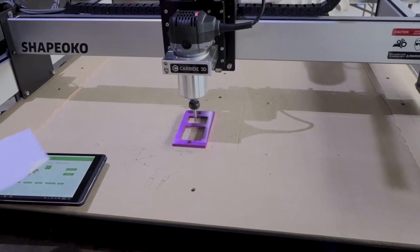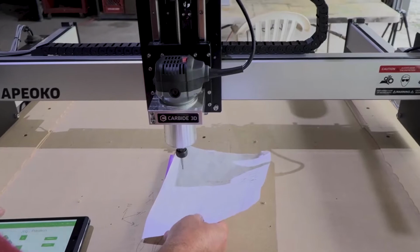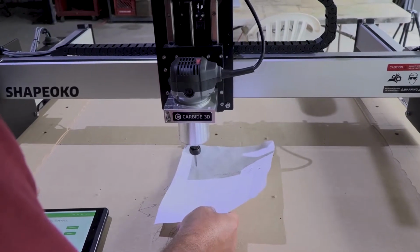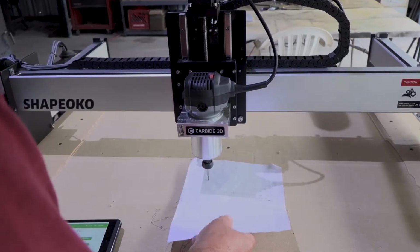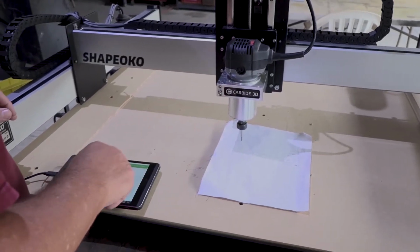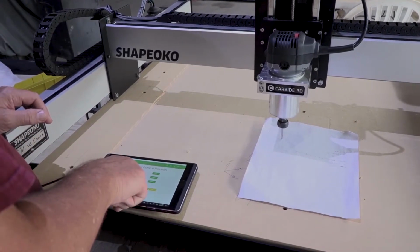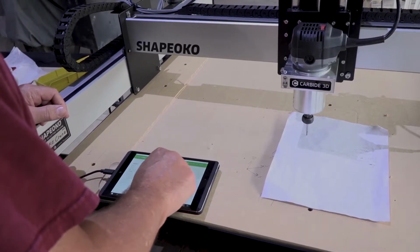And you need your handy dandy piece of paper to do this. Okay, so we're going to come down. Okay, reduce the increment. Wiggle the paper. Wiggle the paper. Oh, there we go. Okay, so it just barely caught the paper. And we're going to go ahead and set the 0 for the Z-axis. And if you see right now, mine's already at 0.4, which is perfect, but I'll show you. So I'm going to 0 that.